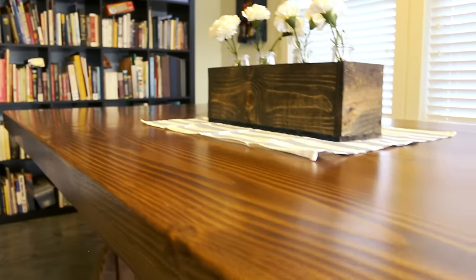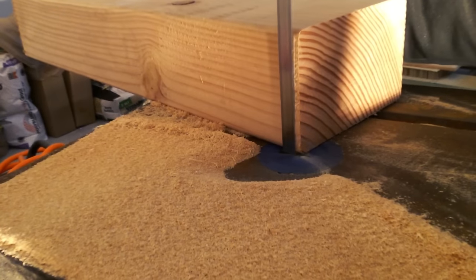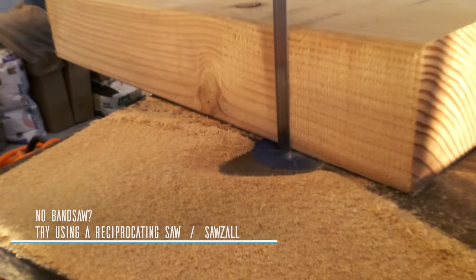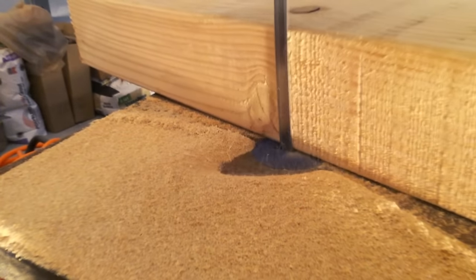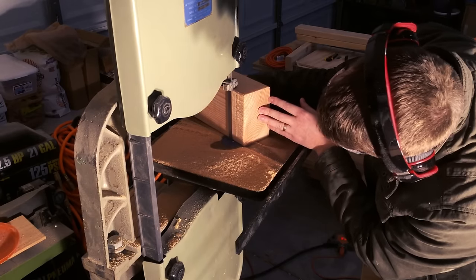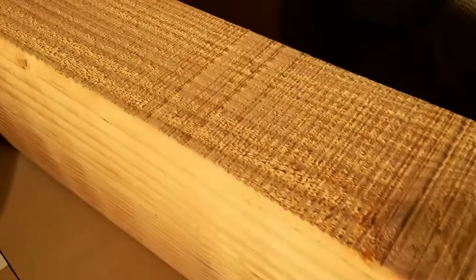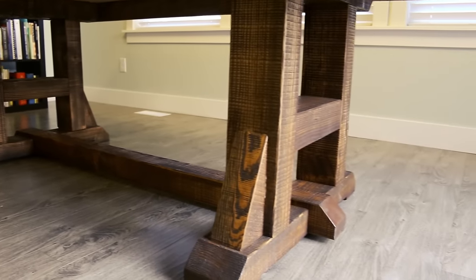Once that was done, I was ready to apply the texture. You can see on the base of the table there's this cool rugged texture on the whole base. The technique I tried that I was most excited about was using a reciprocating saw or a Sawzall, running it along the length of the wood to give it a nice rough-sawn look. I tried that but it really just didn't come out all that great, so I tried running all of the pieces backwards through the band saw and I loved it — it came out really awesome. And when you stain it and finish it, it totally pops. So if you have access to a band saw at all, this is a fantastic way to give the wood a really cool texture all along the base.